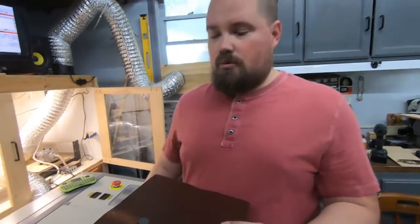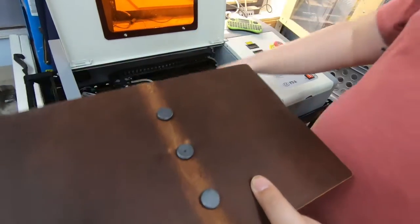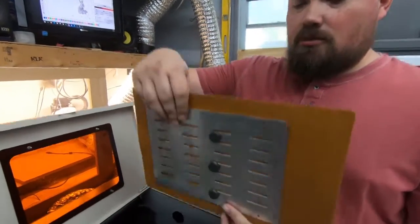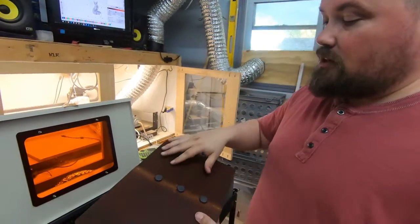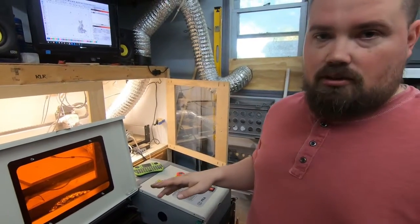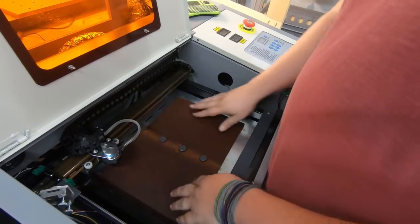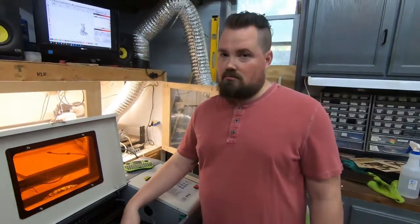This is how we are going to run the journal. It does have a bump in the middle, so I'm using magnets. I pulled the plate out — it's all aluminum, so magnets won't stick directly to it. What we've done is sandwiched magnets top and bottom on the plate. Then I'm going to move the design in LightBurn to get it lined up, because I don't know exactly where it is yet. Let's get it dropped in and lined up for the burn.